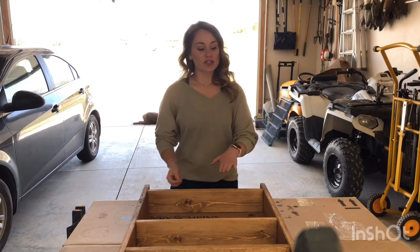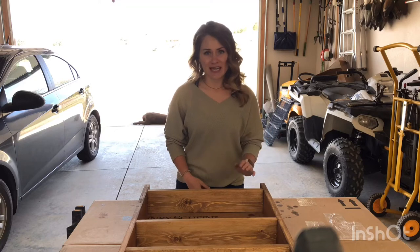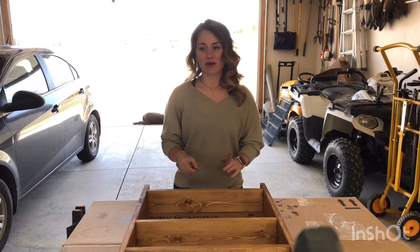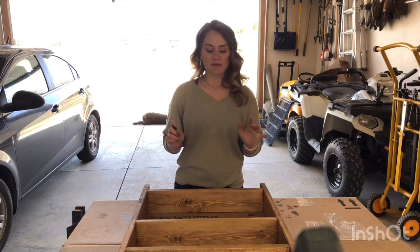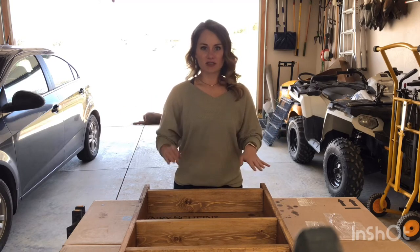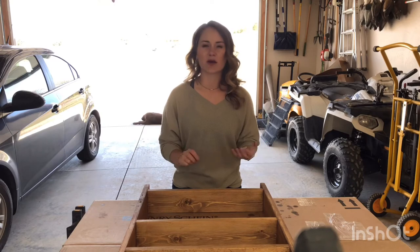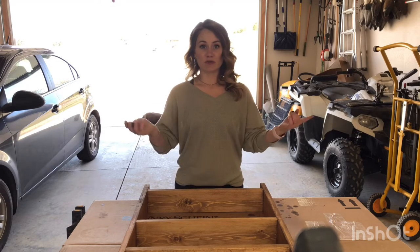Good morning, guys! The shelf has been drying overnight — it's actually been about 19 hours, a little bit of overkill. The stain really only needs eight hours to cure and dry, but I am going to put white paint over the top of it and I don't want the stain to bleed through. Letting it dry for an excessive amount of time is how I prevent that. What I'm going to do next is cover the entire thing with one or two coats of white paint, depending on how it looks. After it dries to be a little tacky, I'll go through and distress the edges — I don't want it to cure completely because that makes it tougher to distress the way I want.